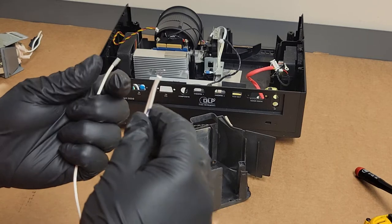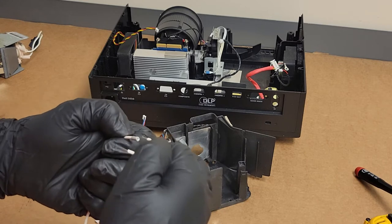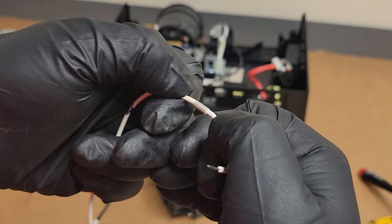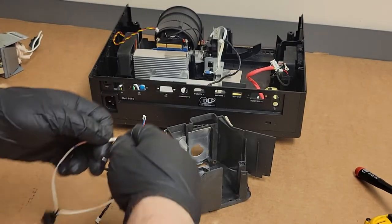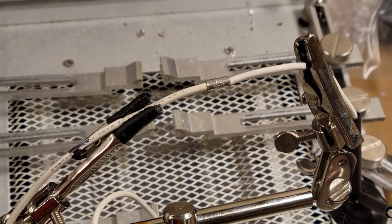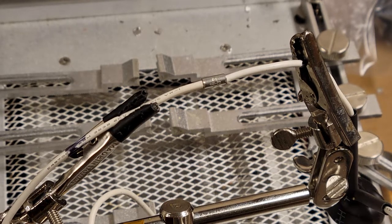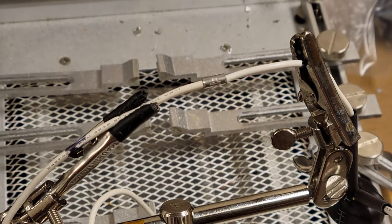So what we'll do, I'm going to put the heat shrink on before I actually do anything, but these actually will share the same space. See, I'll crimp that, flow a little solder in, then slide the shrink tubing over and seal it. Let me go set that up. Okay, so there's the connection. I have the heat shrink in place. Let's hit it with some crimpers, and we'll go from the back side so you guys hopefully can see it.